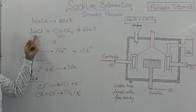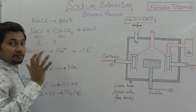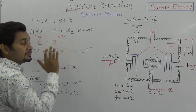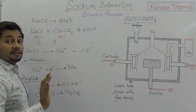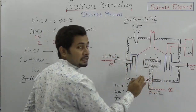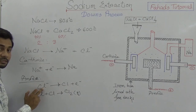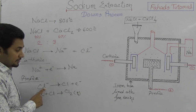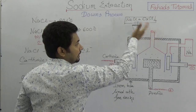To summarize: the melting point of sodium chloride is 801 degrees Celsius, and producing that heat is very costly. That is why calcium chloride is mixed in a 2 to 3 proportion — sodium chloride at 40% and calcium chloride at 60% — lowering the melting point to 600 degrees Celsius, which is comparatively profitable. When the molten sodium chloride and calcium chloride mixture is poured in, the carbon rod works as the anode, which attracts anions. The chloride ions are the only anions in the molten solution, so they release electrons and form chlorine gas, which exits the Downs cell as a byproduct.